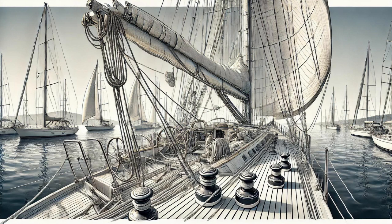Yeah, absolutely. Then as we get closer, we're checking the stays and shrouds for signs of corrosion. Even though sailboat rigging is typically stainless steel, it's still vulnerable in a marine environment. Salt water is brutal. Indeed. Our source material talks about crevice corrosion and pitting. Okay, those sound like serious conditions. Break it down for me. What are we dealing with here?